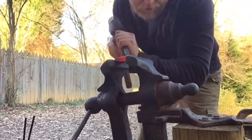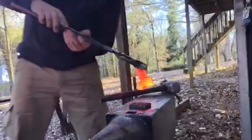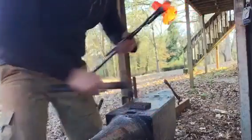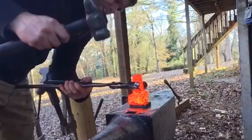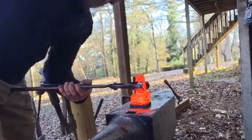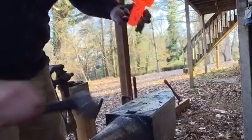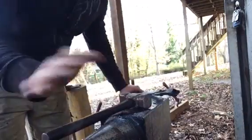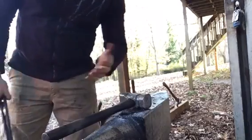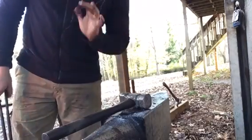You only need to hold the piece of rasp long enough to get the tack done. What we should be able to do is bend the body of the thing, sit it on there, and give it a good tap — that should get it to hold long enough to tack. We're about to tack the face onto this thing. All the same forge welding rules as normal apply — if you haven't seen my forge welding video, go watch it. I'm just gonna give it a few stiff blows, brush it, flux it, and back in the fire.